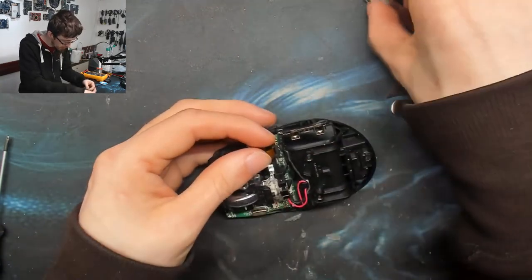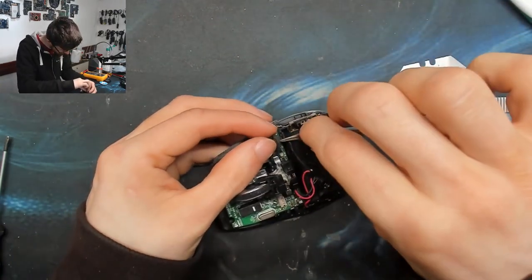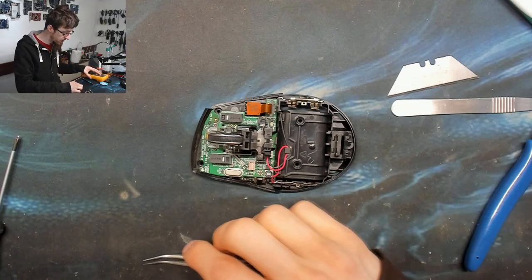The laser sensor is clean so I'm going to leave it alone. When I first took this apart just for the recce, when I put it back together it didn't track very well — I had to take it apart a second time to clean the lens. So watch out for that: if you don't have to take the sensor out, I wouldn't. I don't think you'll damage it, but it just wasn't necessary to remove it.